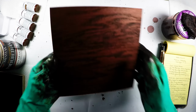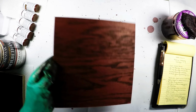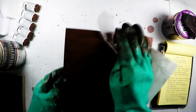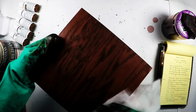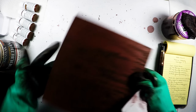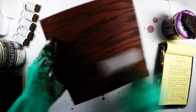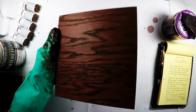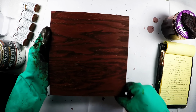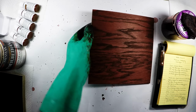Okay, so as you can see, it was pretty easy. I just worked it around for a little bit. The thing that's nice with this is by adding the couple drops of black, it not only darkened up that dye stain, but it's also going to end up help contrast those grains, these deeper grains that are in something like this oak here. Boy, that's showing up pretty decent. That's good. I like that. Anyways,